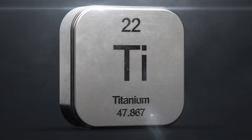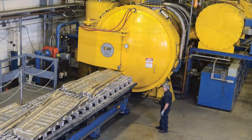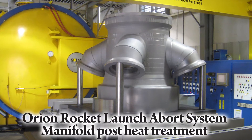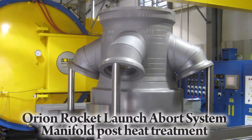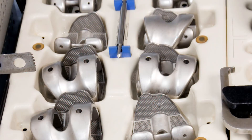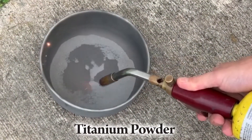First, let's review what titanium is. It is a silver colored metal with the highest strength to density ratio of any metallic element. It is also well known for its excellent corrosion resistance. Because of this unique set of properties, it is widely used in critical aerospace applications. But one additional and very important property of titanium is that it is biocompatible, meaning it is suitable for medical implants. Screws, staples, plates, prosthetic joints, and device enclosures for pacemakers and defibrillators are commonly made from titanium and its alloys.